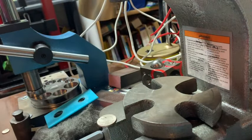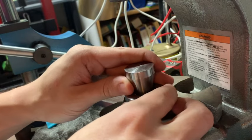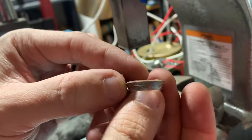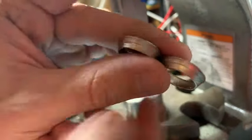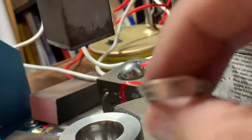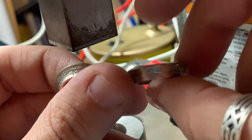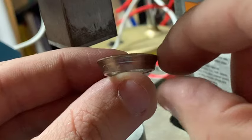Then from there I'll move back to the 17-degree die, place the 17-degree cone on top, and just finish that fold. That's what we get and I really like that two-step folding process. Let's compare these two. This is the one I folded twice, and this is the one I folded with just the 17-degree die. Maybe to the naked eye they don't look too different, but this one is way straighter and more even, and that's going to make it easier to turn into a ring.